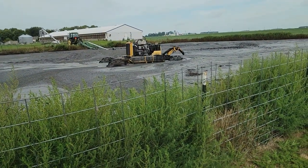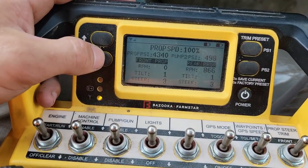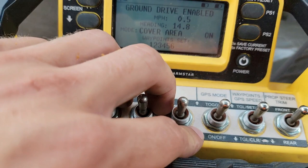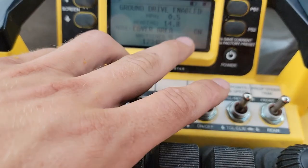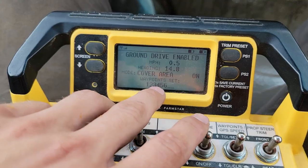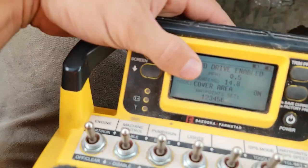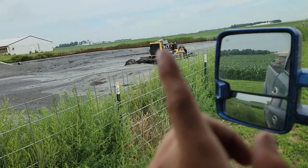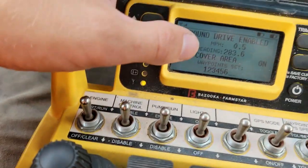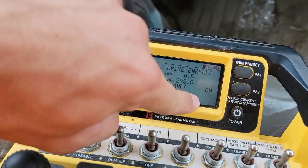For your lights — up turns lights on, down turns lights off. For GPS mode, if I go to my GPS screen right here, I have it set to cover area. All my waypoints are shown and it's set to on — hitting it down would turn it off. You can change between cover area, anchor, and point-to-point. Point-to-point goes from point one to two to three to four. Anchor mode keeps the boat within about 10 to 15 feet of its current position even if wind or the gun tries to push it. Cover area works everything within the whole area defined by your waypoints.